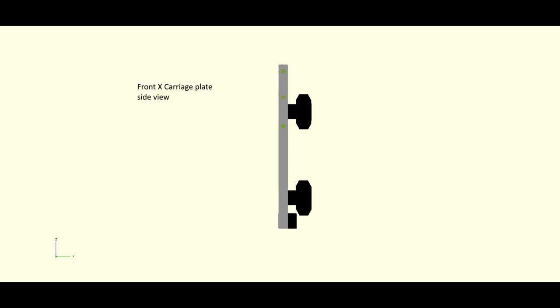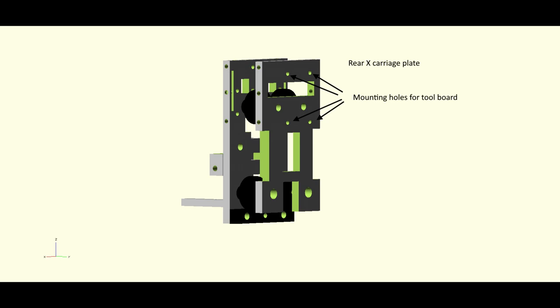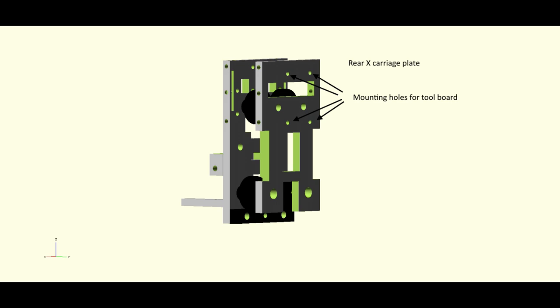Here's a view from the back and from the side — spaces are on the other side of those V-slot wheels, just not showing in the render. This is how it all fits together: the mount the LGX is screwed to, fitted to the mount that gets bolted onto the carriage. There's another plate similar to the front one that goes on the back to form the complete gantry. This one has four fixing holes for the tool board — I'll be using a Duet tool board on this carriage. Here it is fitted on the X rail.